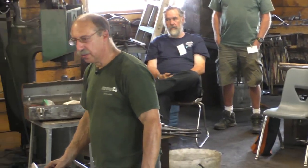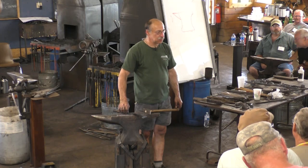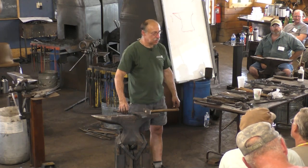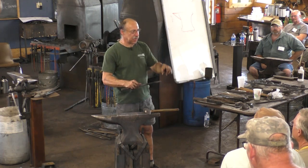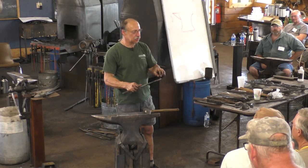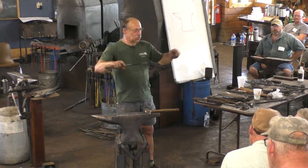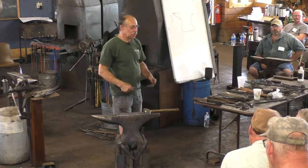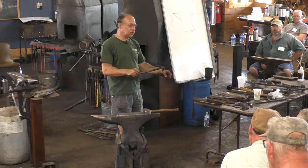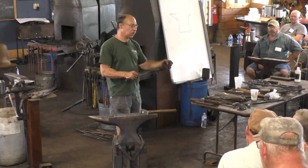Peter. All right. Yeah, one more question. Do you have any tricks for making that square corner to dimension, to a length dimension? Yeah, if you do it what I did, you can make the peak of that mountain where you want the corner to be. So you can make two of them a certain distance apart, and that's how far the corners will be apart. If you're starting with a uniform bar and you bend it and upset it, you'll lose half the thickness of the bar in each dimension.